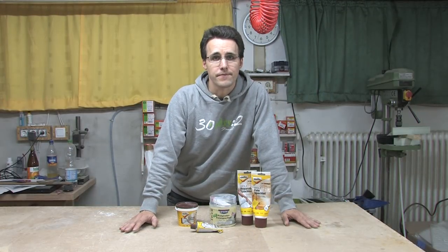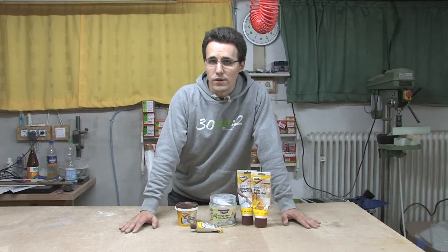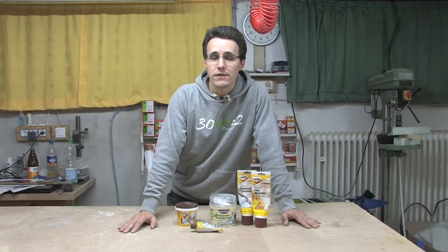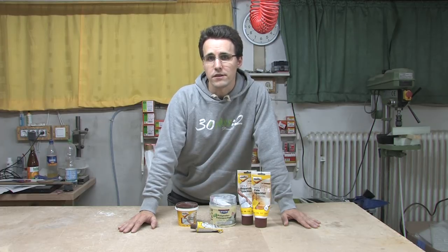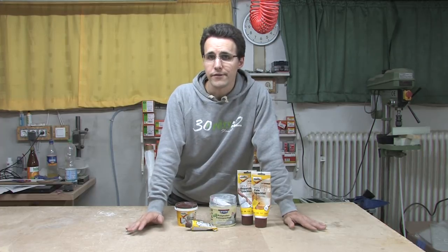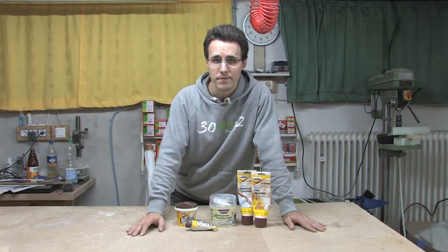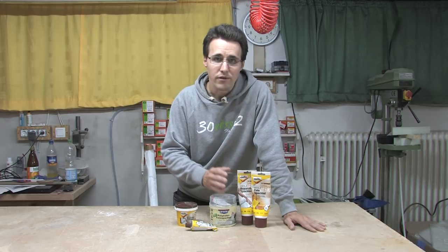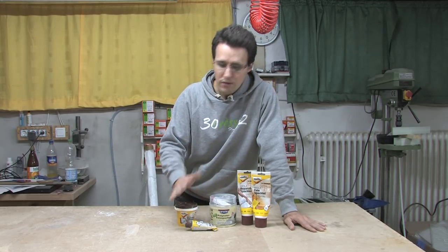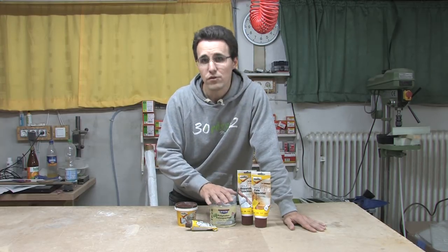During the build process, I tested different types of fillers. You have to close small gaps or little cracks in the wood. But there's also the need of modeling smooth surroundings on inside and outside edges. I couldn't find a filler that could do all the jobs. There are fine fillers for very thin coats and others for big gaps. They all need long drying time, and I think especially the two component fillers are not very healthy.